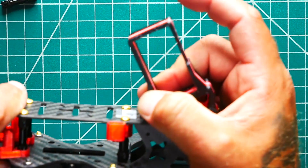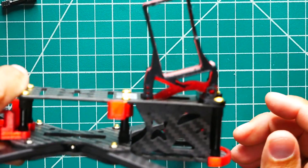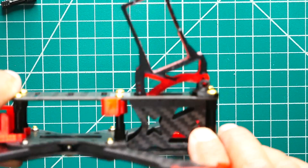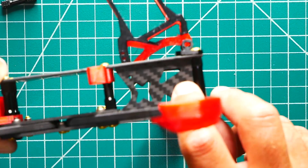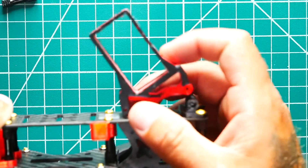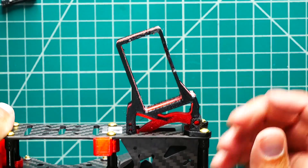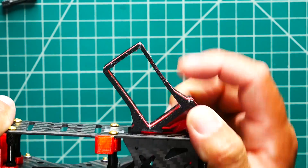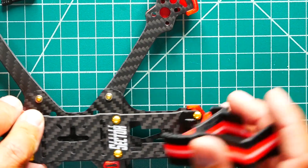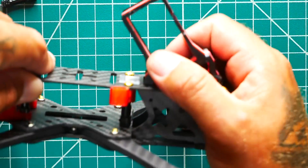You can literally adjust the tilt angle and lock it in at whatever degree you like to fly — and you match it to your FPV camera angle, which also has multiple hole positions here for 25, 30, 35 degrees and so on. If you're racing and flying fast, you tilt up higher. I thought this was so cool when putting it together that I left it unbolted just to show you how it works.